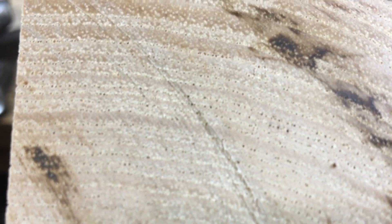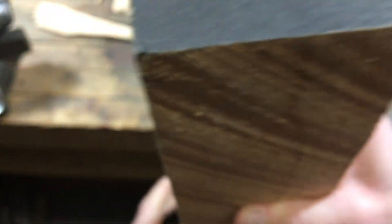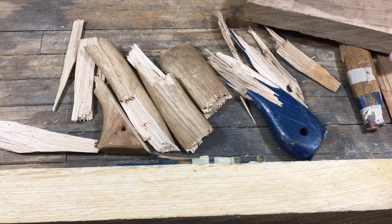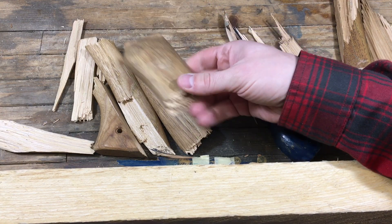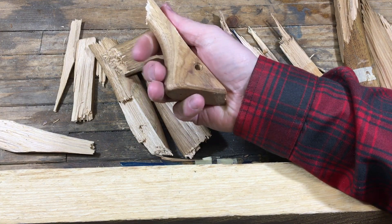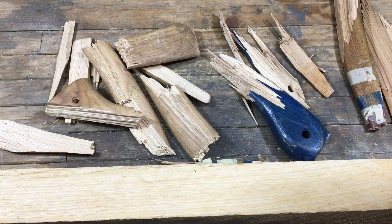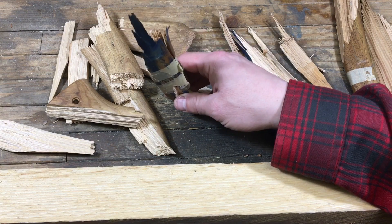Lesson learned. From now on I will be checking the end grain for pores. I want fresh-sawn — looking at this end I can actually see the porousness in the hickory now that I know what to look for. It was kind of fun breaking the axe handles but kind of sad at the same time — this handle was really one of my favorites that I've ever carved. It turned out beautiful, it felt great in the hand, but the wood was garbage. Look for opportunities to give old things new life. Don't forget to like and subscribe — we'll see you on the next video.